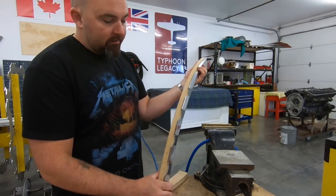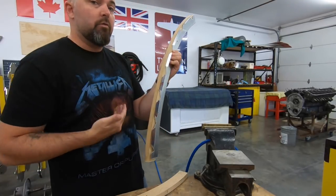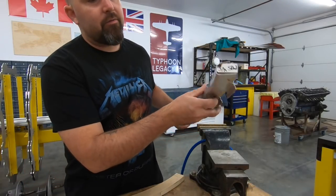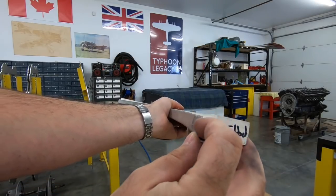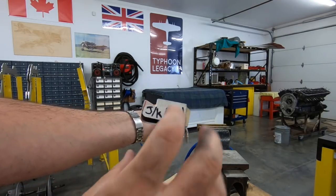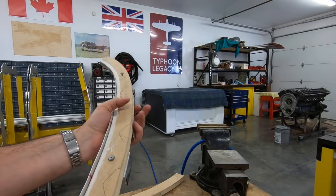Because even if it's just a little bit off, you'll end up — you can see now it looks like maybe there's something over-shrunk there because there's a curve. Well, it's not. That was all true when we moved on to the next bend, so we know where the problem lies, or we know where the work requirement is. Back to the form blocks — you can see that we have a reduced profile here, which is going to form that secondary bend. There's extra material and it's a little bit over-stretched along this flange, which is going to help us ultimately.